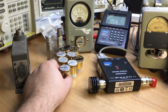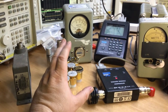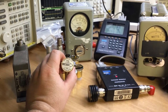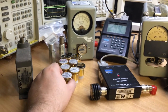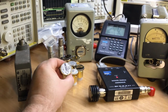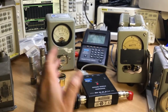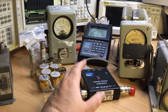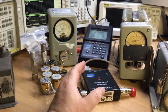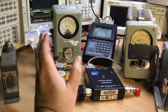You've got to be careful with purchasing these meters, because when you weigh up buying one of these meters with all the slugs for measuring different frequency bands and RF power levels, it can get out of control. You can end up paying more to buy all the inserts along with the meter than if you purchased something like the Bird 5000 EX, which does exactly the same but is more refined, has better calibration, and can measure digital and sideband transmitters.